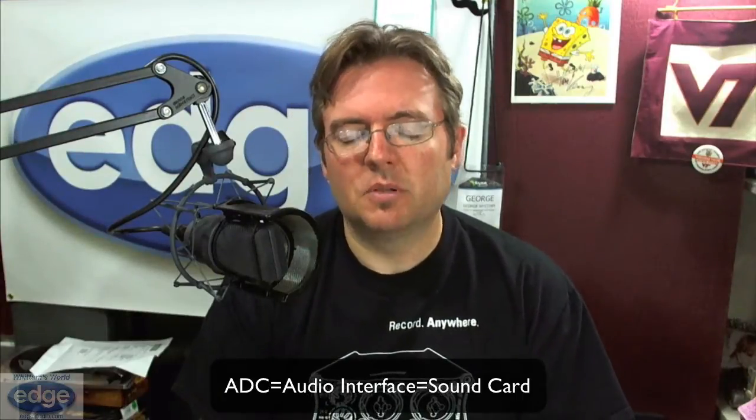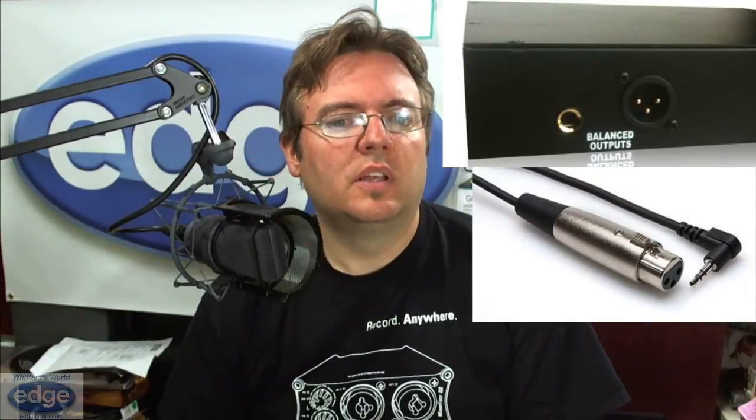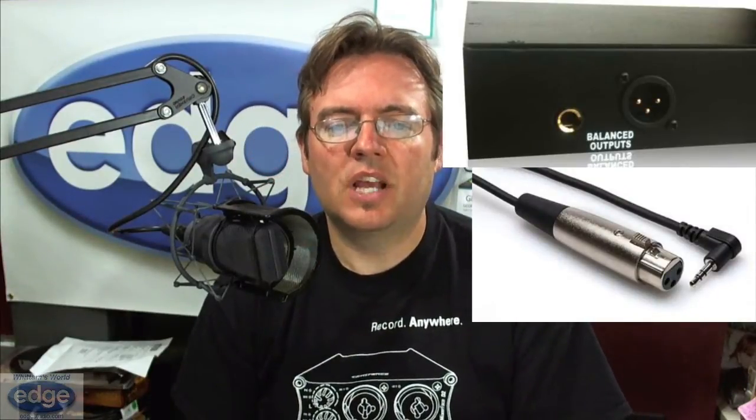In regards to Mike's question, he has a few terms that are a little confusing. I guess he was expecting that the Warm Audio WA-12 was itself an audio interface and that it would have its own USB jack to plug directly into the computer. The WA-12 is really a professional piece of studio gear that was never intended to be plugged directly into a computer. Because of that, it doesn't have its own analog to digital converter or USB jack. What you did come up with, Mike, was a workable solution — taking the XLR out of the back of the WA-12 and sending it into the eighth-inch jack of your computer.